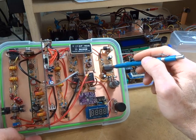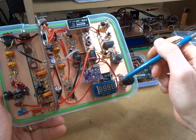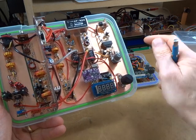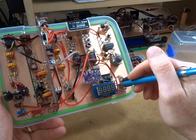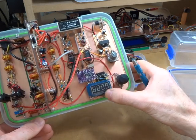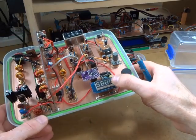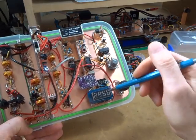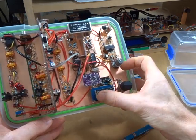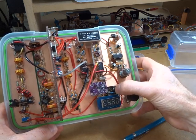The audio frequency amplifier up here is an LM380 — I'll use that again. Rather than an OLED display, I'm going to use this little four-digit seven-segment display. The last couple of radios using these have been really RF-quiet, which is good. I've had problems with OLED displays being a bit noisy and no matter how much shielding I tried I couldn't make it work. With this display, push the switch for fine-tune mode, push again for faster tuning step. A push-button will cycle through three intensity levels to save battery current.